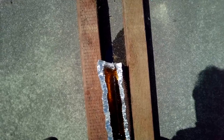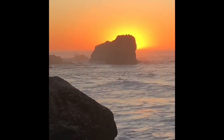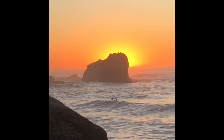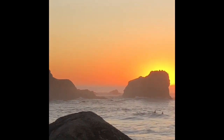I think sometimes when they're put in too hot, they're more likely to cause a warp, but this one went in just at cherry red. Nice and hard on the cutting edge — file skated across. Hopefully this will be helpful for you to get your sword heat treated. Thanks so much for watching. Please subscribe when you get a chance, and we'll send you some more videos on forging and fire. Thanks again.